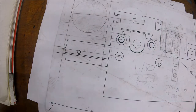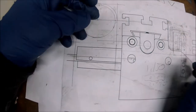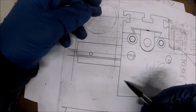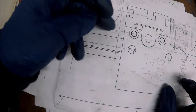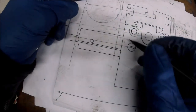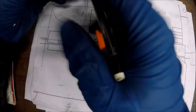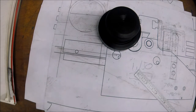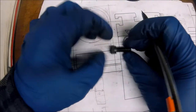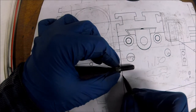Thickness-wise, this is going to be 1 inch overall. I'll bring it down to about 0.9, and from that 0.9 the total bracket thickness is 0.8. I want to recess the flange so it's up against the plane I mentioned. 0.8 minus 0.3 flange thickness gives me half an inch. I'll use 5/16 bolts — one in this area, one in that area — and then end the block right about there. I'll counterbore these, and about half an inch of material left in there should be good — it's a stop, and we'll be hitting it with a screw-driven load.